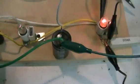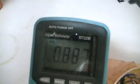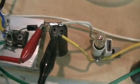And the reason for that we'll get to shortly. This little incandescent bulb here is a 6 volt bulb that is simply burning off the power being delivered to that cap from our inductive kickback spike. It's barely glowing, but it is. That's reading the voltage across that cap and across the globe.